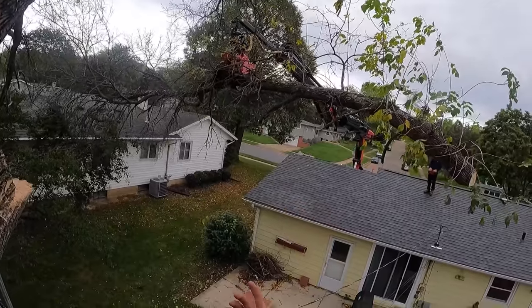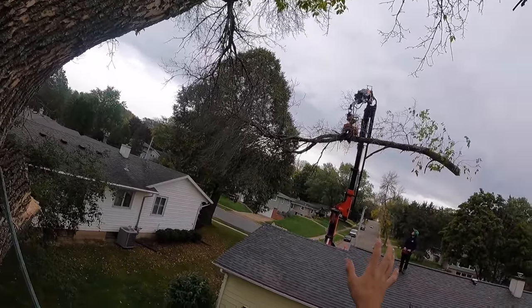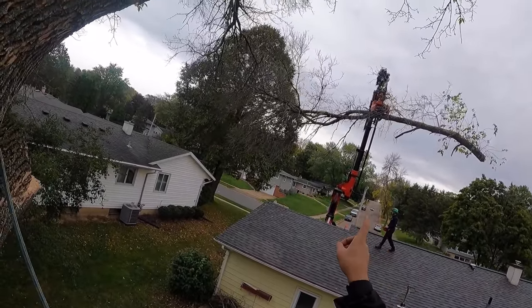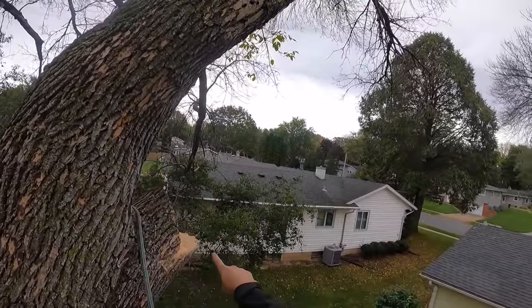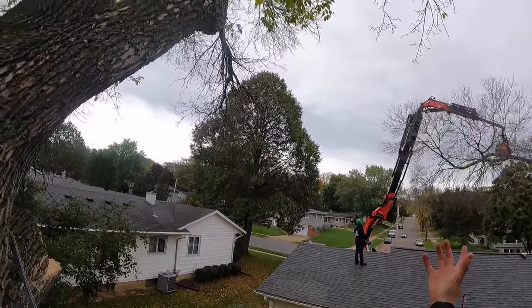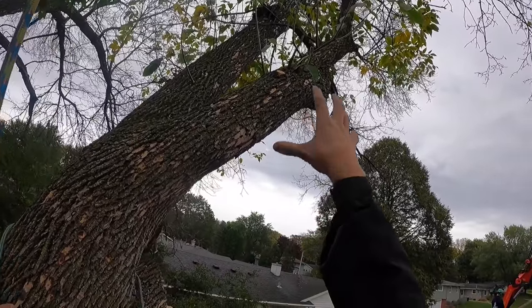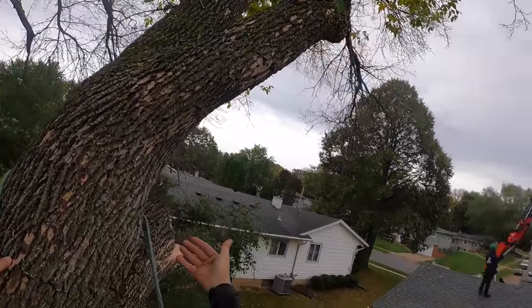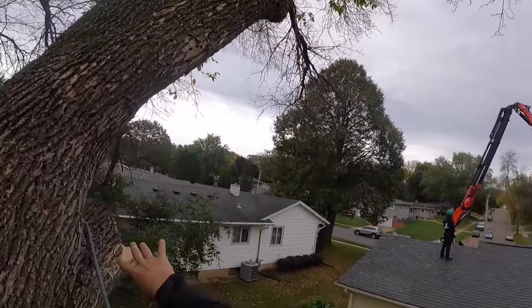The fact that you can deliberately spin it. So what Reon said is if you like doing crane work regularly, there's more opportunity with this one versus the stick crane. You know how he just took this limb off? He snuck under here, took it out, spun it, and then went out. A stick crane, you wouldn't have been able to do that, really. You'd be interfering with all this stuff. Basically, if this were a crane removal with a stick crane, I would have taken the top of this all off, but he's able to sneak this out.